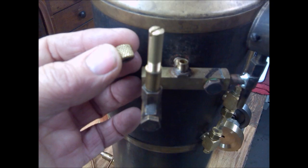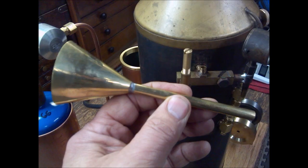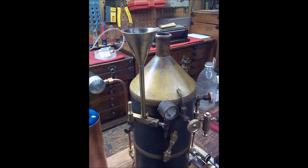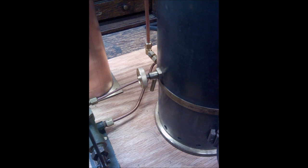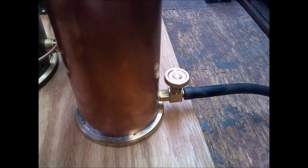First we've got to put water in. That's the water inlet for the boiler. Take the cap off — I made a funnel, it's got quarter-by-40 threads in it. Screw the funnel onto the top, and believe it or not it takes up to two quarts of water to fill that boiler. This is a hand pump that is used during the firing process to add water to the system as it's running.